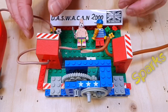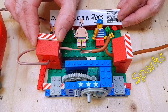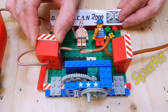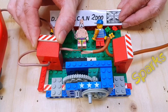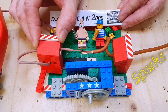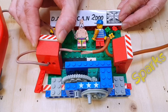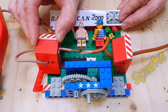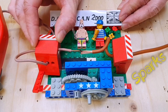Let's see if we can see that current drop off and back on again. It's all a bit fiery and fizzy. So we're creating some decent sized arcs here, drawing almost 18 amps. We've got a serial arc. The device is not operating - certainly haven't seen it do so today - and yet there are some rather high temperature localised events happening.